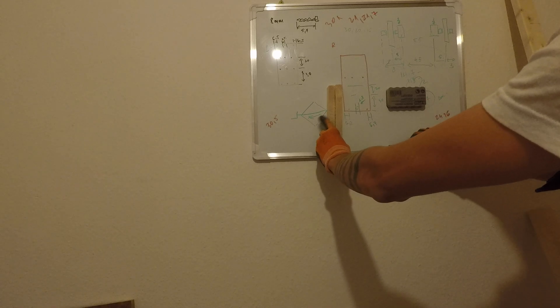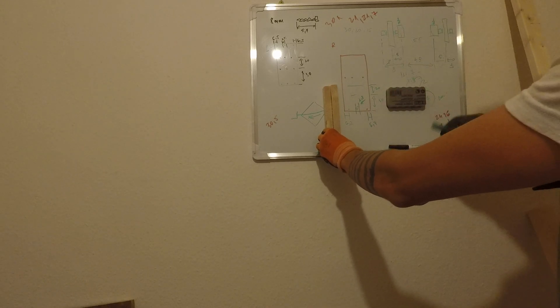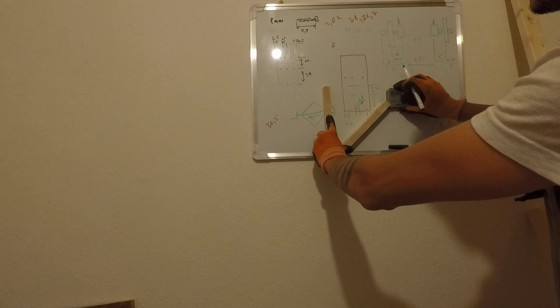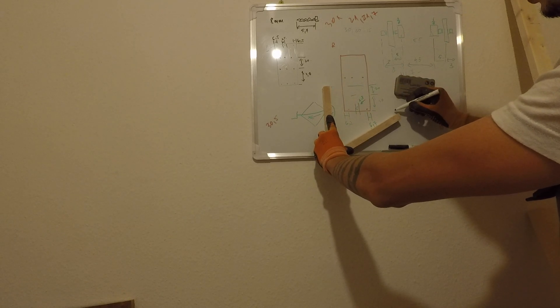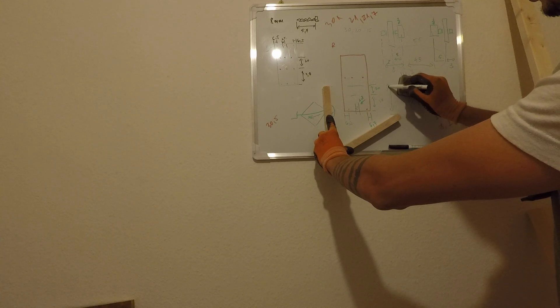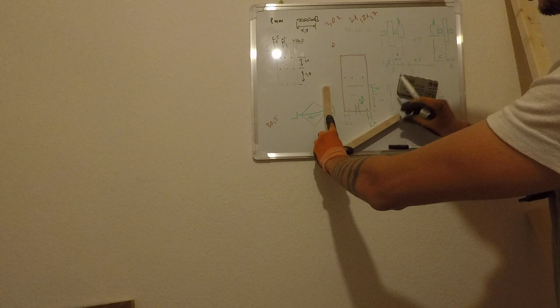My router spring has a compressed possibility of about 5 cm, so I have to make sure that my lift has a vertical movement of at least this distance. Supposing I will use this length of wood pieces for the lift arms, the vertical distance between the maximum closed and maximum open position is about 6 to 7 cm.